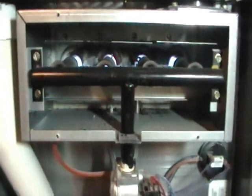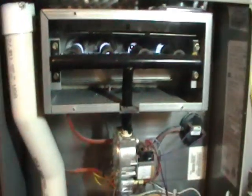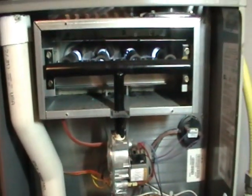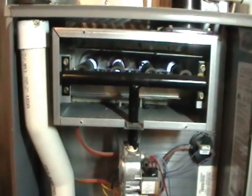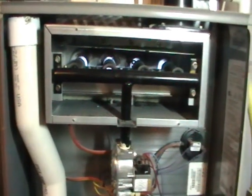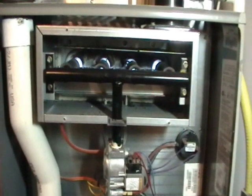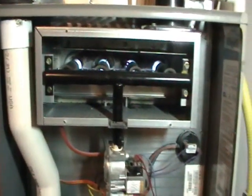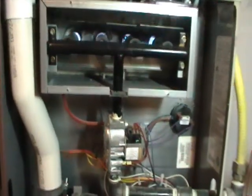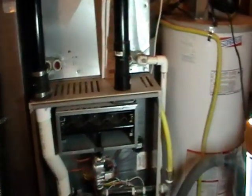I want you to remember that if you smell gas, or see any signs of poor venting like black sooting or staining around the combustion chamber or draft diverters, call a professional. Poor flame characteristics as well require professional attention, and if there's any sign of heat exchanger corrosion, or vent gases that can be smelled in the area or in the home, it can be a sign of a failed heat exchanger or other problems that require immediate attention. Carbon monoxide is a very real health concern, and a CO detector is always a great idea in the space or in the adjacent hallway.